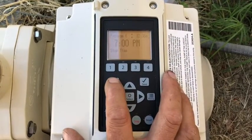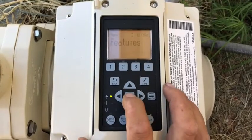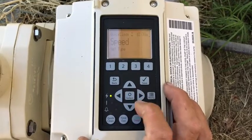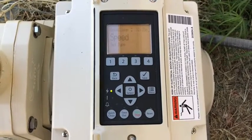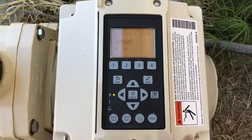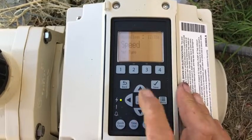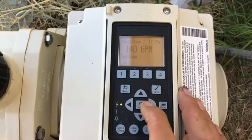Now we're going to go over to Features. This is where I can program Quick Clean — my favorite thing to use. Quick Clean is a one-touch button: I push it and this pump will run at a pre-programmed speed for a pre-programmed amount of time. When the timer runs out it shifts back over to whatever it was supposed to be doing during its normal schedule. I use it for backwashing, or if a storm is coming in — hit that Quick Clean button and let the pool stay on top of things. I'm going to set that for Flow.